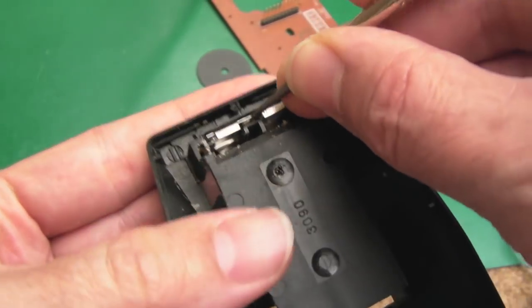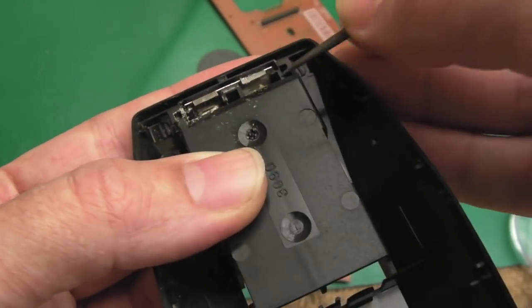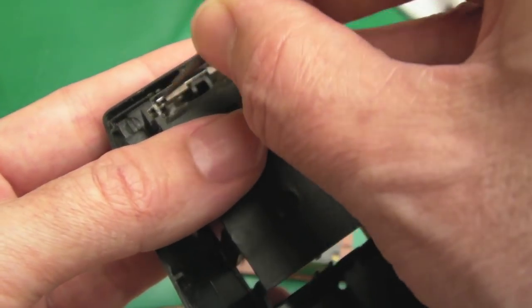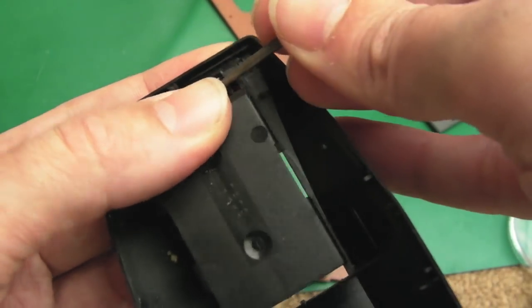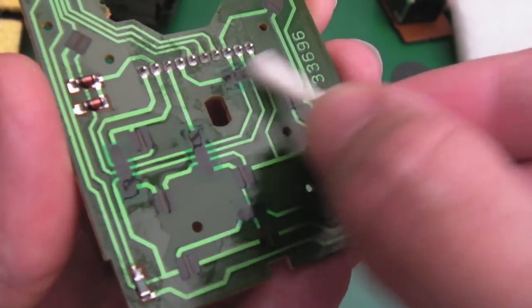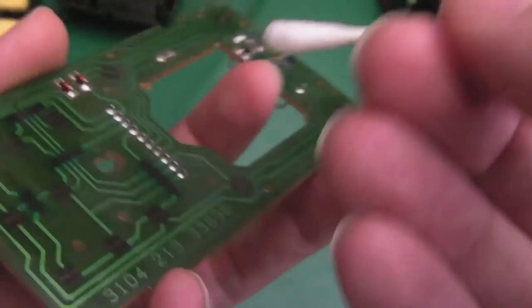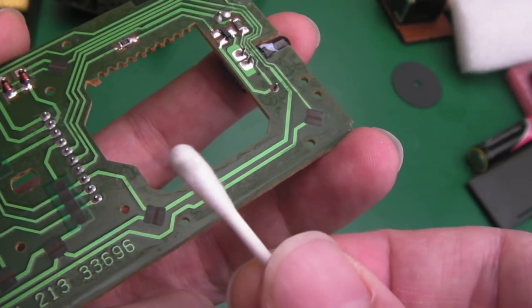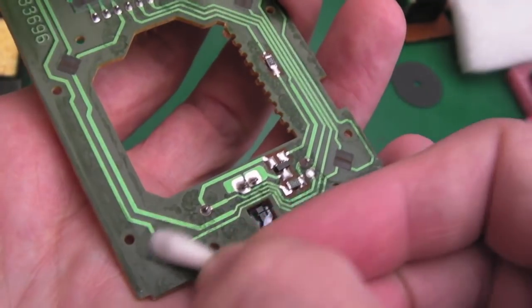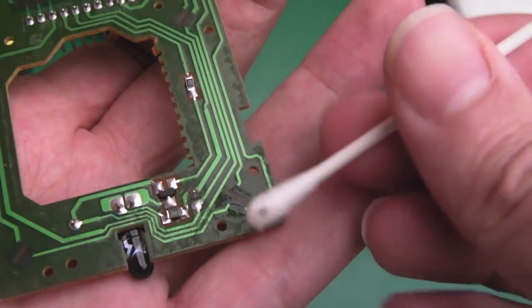I think it might be that center point there holding it in — that's sometimes how these things are clipped in, clipping over a plastic lip. We could clean it in position, in place, but I'd prefer to pull the thing out, if I'm honest. I'll clean up the contacts under here with a bit of IPA — just a little bit, just wipe them down. They're pretty clean, to be fair. You don't want to rub too much here or put too much pressure on these contacts, because you can wear down the surface. Can you see a very small amount of black color on there? That's the carbonized stuff — it's conductive. It's probably some sort of graphite carbon compound.